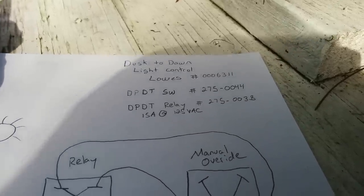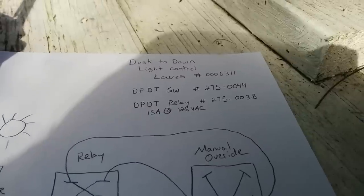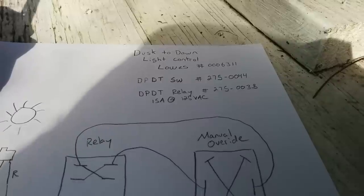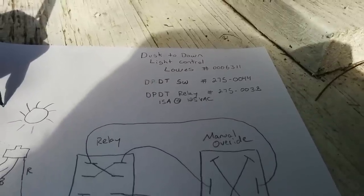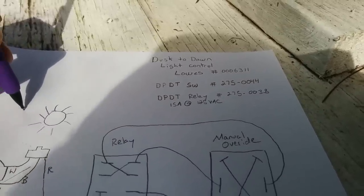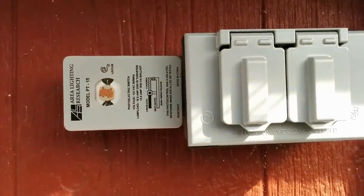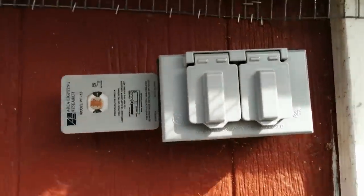You can get whatever stroke length you want — I found 12 inches was nice for me. You could get more if you have turkeys or something, but 12 is good enough for my little birds. You could even use this to open a full-size door on a hinge. The longer the stroke, generally the more expensive the actuator — an 18-inch one might be closer to 100 bucks. Anyway, there you go — there's the schematic you can pause if you need to, there's the photo cell, and this is dirt simple folks. I hope that was helpful.